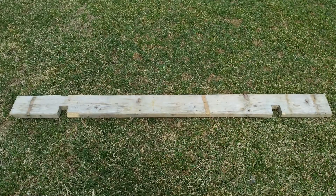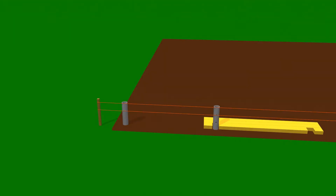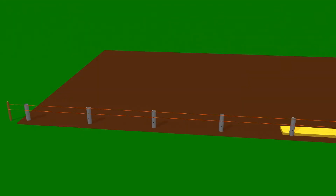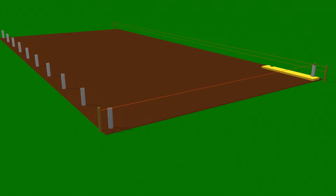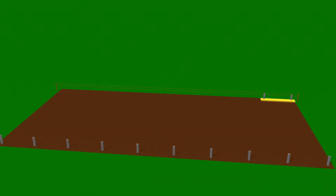Our tunnel producer provides a collar guide to give us the correct spacing between collars. If one is not provided, you will need to measure the spacing or fabricate a guide yourself. For our tunnel, the collar spacing is 4 feet center to center. Drive the remaining collars in on the first side based on the specific spacing provided by your tunnel kit instructions. As you start installing the collars on the opposite side, make sure that those collars are level with the ones across the tunnel. If you don't, the bows will not install correctly. Repeat the previous steps and drive the collars of the opposite side into the ground.